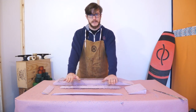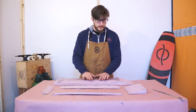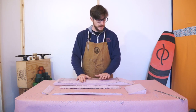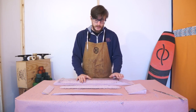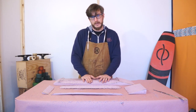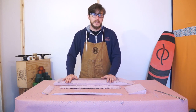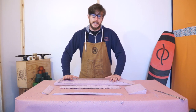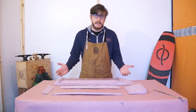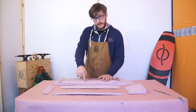The next step is to take our pieces of foam that we just cut and attach them to our backing boards. You can go in at this point and clean up your mold pieces if you want — sand them out, smooth them out so they're not so rough — but you don't have to. Because we're using a stiffer material, the Baltic birch, and because the foam has a little bit of give to it, even though the surface is rough there'll be enough surface area in the right places so that when we squeeze it down, the pressure will get applied where it needs to go. You can go in and clean it up — it'll make it look nice — but this is going to be good enough.